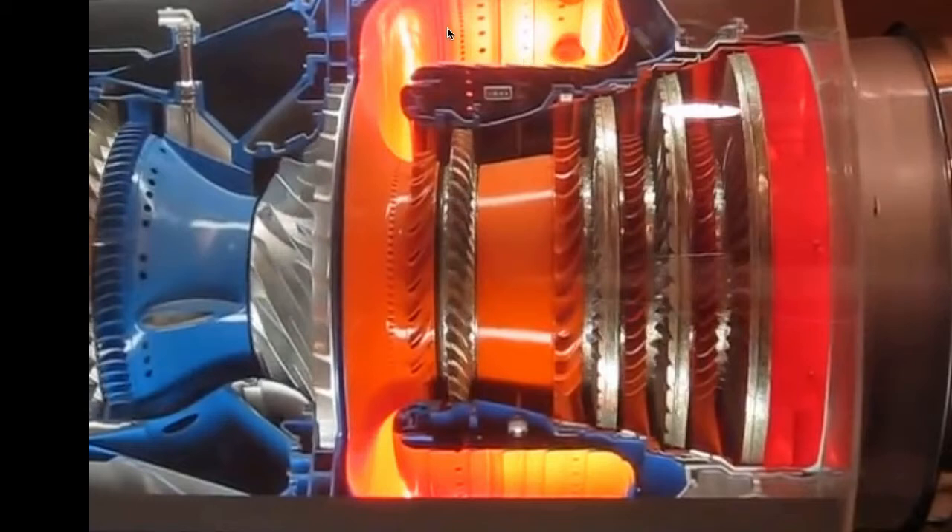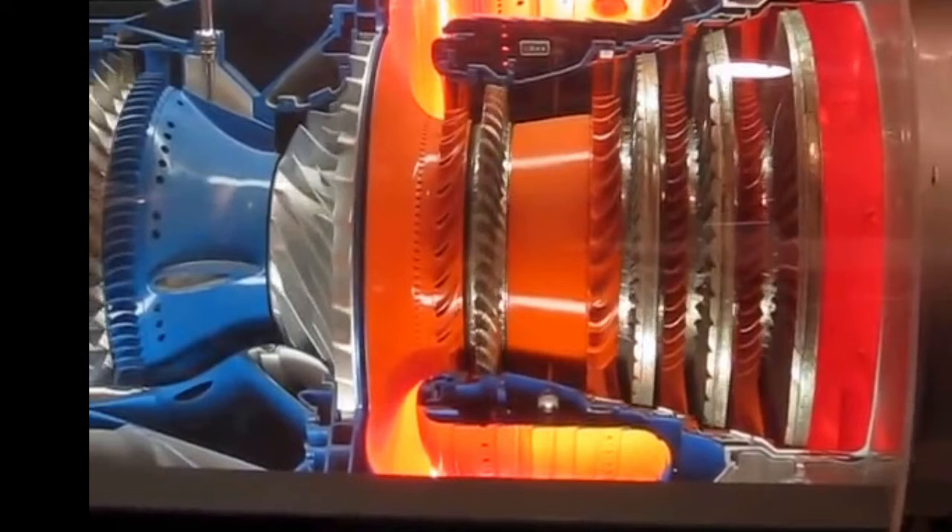Because the pressure is so large on this side, it pushes the flame back down through here. There is a fixed stator right here that directs the flames onto the first power turbine. The expanding gas mixture of jet fuel and air comes back through the stators onto the first power turbine. This first power turbine is connected by a shaft to the high-pressure centrifugal compressor. The high-pressure turbine and the high-pressure centrifugal compressor are connected by a shaft — that's important to understand.